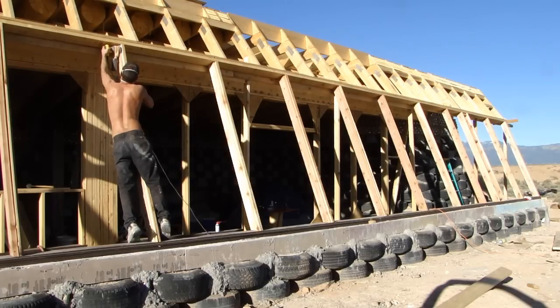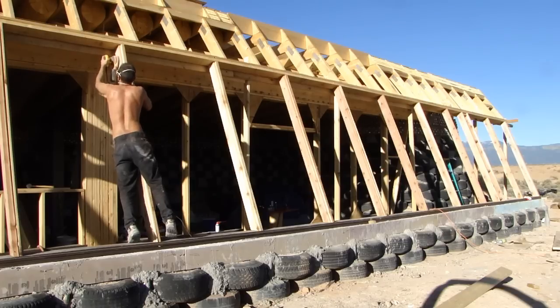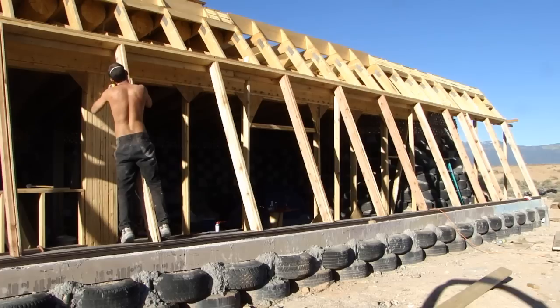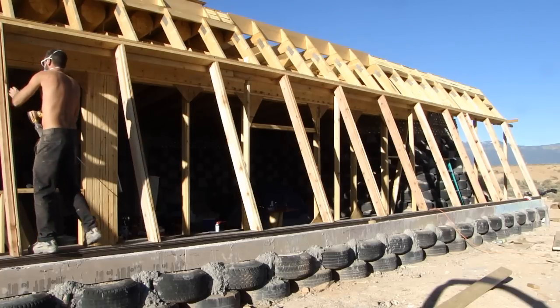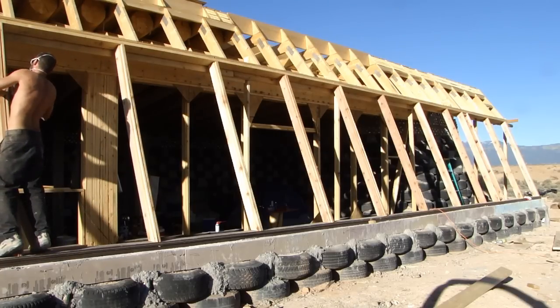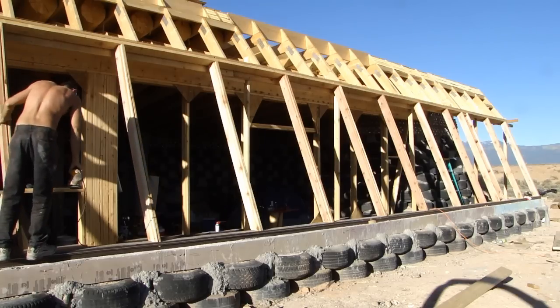Now I really love building this house, but sanding is something I am just not meant to do. So here I am pretending I'm having a great time sanding the front face mullions for the greenhouse. These mullions are made out of redwood — 2x6 redwood pieces with the same rabbet joint cut in them as I did for the vertical greenhouse wall, to accept the panes of glass. I started with 60 grit sandpaper and worked my way to 150 grit for the finish.